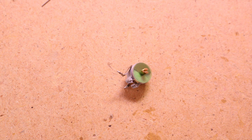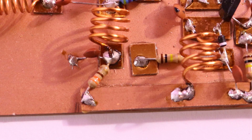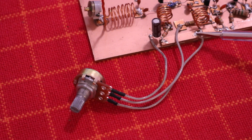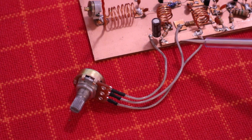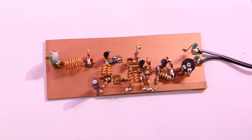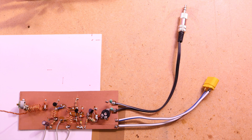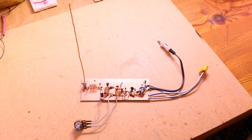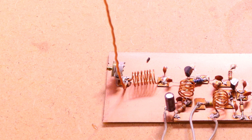From the last pad to ground I added a 40pF trimmer capacitor, and then a 10μF capacitor from plus to ground. To control the frequency with the varicap, I added a 10k ohm potentiometer with one pin to plus, the other pin to minus, and the middle pin going to the pad with the 100k ohm resistor. Then I added the audio cable with minus to the pad with the inductor to ground and plus to the other inductor. At the end I added the power cable with plus to the long piece of PCB and minus to the rest of the PCB. The antenna I soldered to the pad with the 40pF trimmer capacitor, and then the transmitter is done.